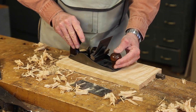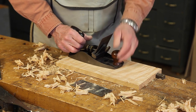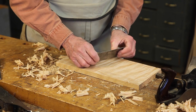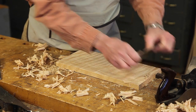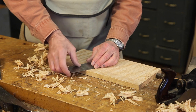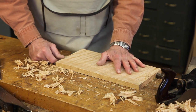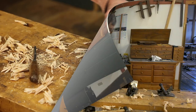This is the Stanley 112 — there are lots of reproductions of this made. The blade, just like a regular cabinet scraper, is leaned forward and it cuts by a burr that drags. Because that burr is just like a little hook, it isn't long enough to tear the grain very much. The first order of business is to sharpen this correctly.